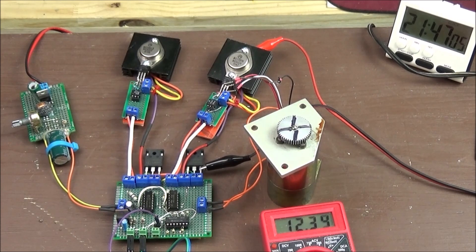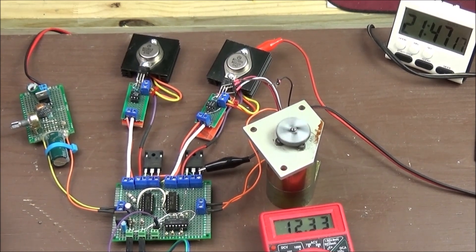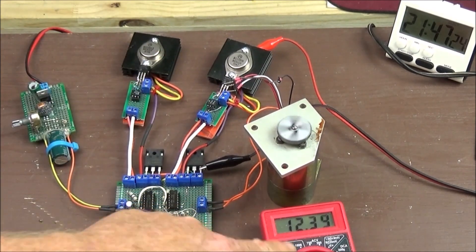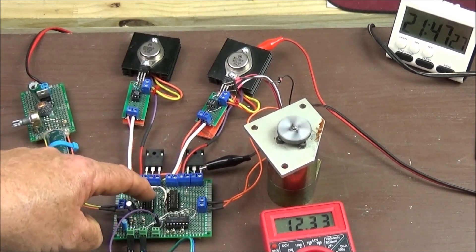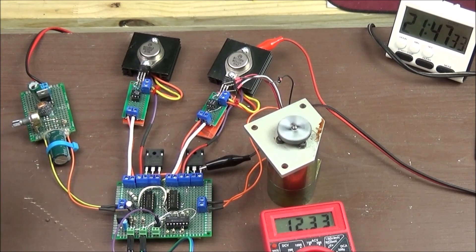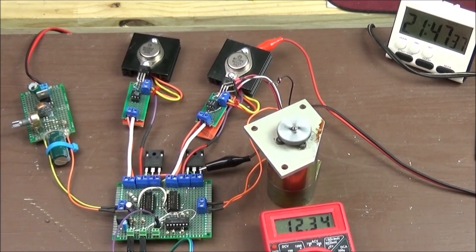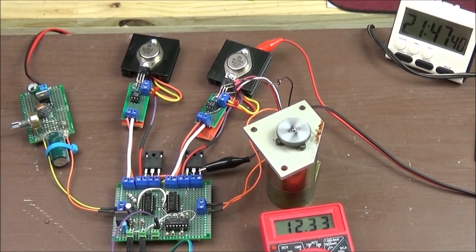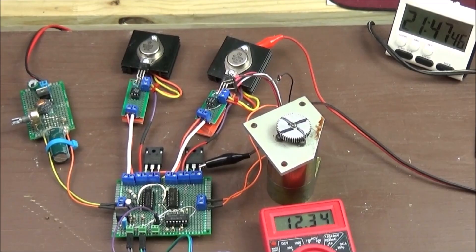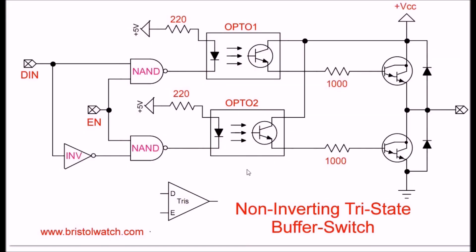Here is my H-bridge motor control circuit again — that's the power output from this switching power supply, a different project. We're going to be looking at how optocouplers, which in this case are used to isolate, help isolate the higher voltages. Beyond 15 volts if you're using CMOS, you can use a higher voltage motor instead of this 12 volt motor — you can use 24, 36, or even 48 volts.